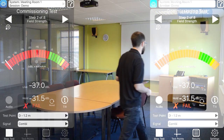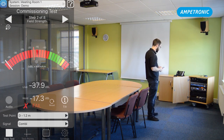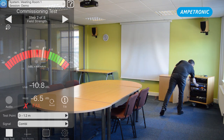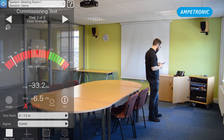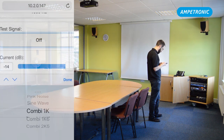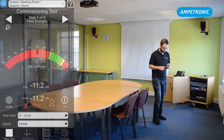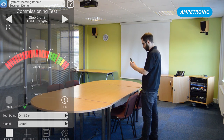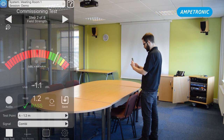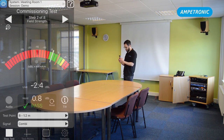Click the next arrow or swipe across to move on to step two, field strength, and turn on the amplifier. We're using a D-series amplifier, so we're going to control this via the web browser on the phone as we've got it connected to a wireless network. If you're using a standard analog amplifier, then you'll just use the controls on the front and rear of the amplifier to set it up. In the config page, we can choose one of the inbuilt test signals. If you're not using a D-series amplifier, you can just use a signal generator or an MP3 player to get these tones into the amplifier. We want to use a combination tone for field strength measurement, and we're looking for values between plus 3 and minus 3 dB at each position. Move to each position, select the test point, hold the app upright, and press save.